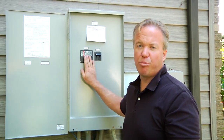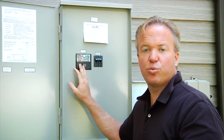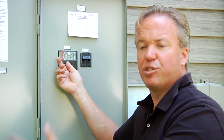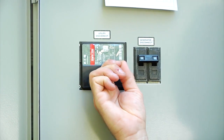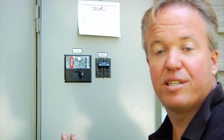So we're going to go through the sequence. This is the mainline circuit breaker for the house — it's 200 amps. Basically the service comes in through this switch and the transfer switch then distributes that power through the rest of the house. I'm going to throw this breaker, which is going to commence the start sequence for the generator. I can hear the transfer switch clicking — it's beginning its timing sequence.